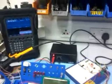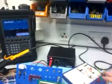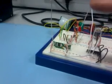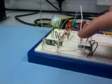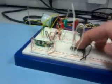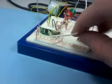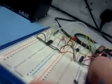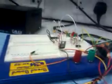So as we can see on the spectrum analyzer, there is nothing there at the moment, and as soon as I put my hand past the PIR, we have activity. The initial problem with the PIR is, if I swing it around here just to show, the transmitter part. In other schematics, the transmitter always had power going to it here. So I introduced a NOT gate into the system here, so I would be able to shut it off outside of transmission. So if I take it out here and put it to where originally they always had it, and I turn the PIR away from me, I can demonstrate what the problem was.